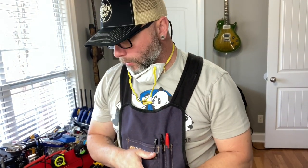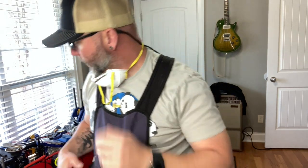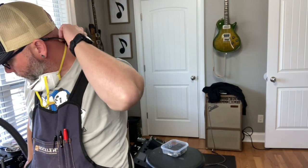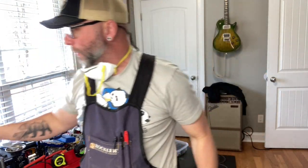All right, guys, so we're back, and we're going to finish sculpting this side of the bridge that I've glued on Rob's Dove. The rough sculpting gets done with a belt sander in my shop. You can do it with a chisel. You can do it with the carving tools. I prefer to use the belt sander for this job, but it's almost like it was just about made for it.